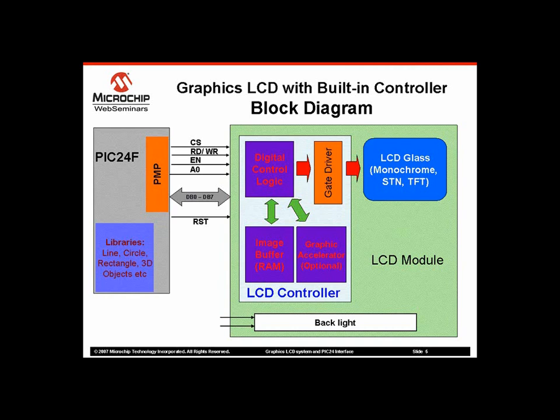Almost all LCD controllers operate at 3 or 3.3 volts. If you have only one supply available, then parallel LED configuration is preferred, as the backlight may be able to run on the same 3 volt supply. For series LED configuration, you will need a higher voltage. The bigger displays may use a different kind of backlight like CCFL. This may require an inverter to generate high voltage.